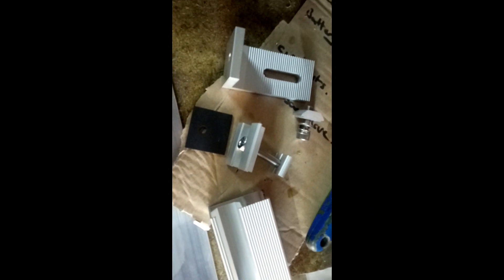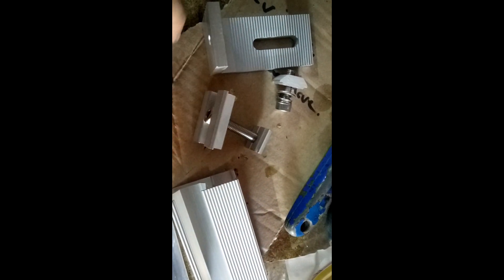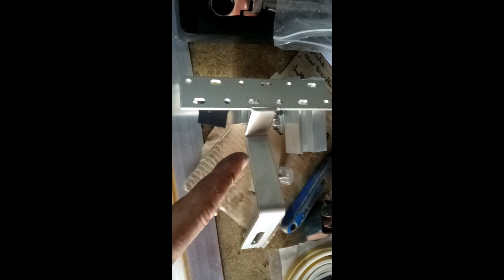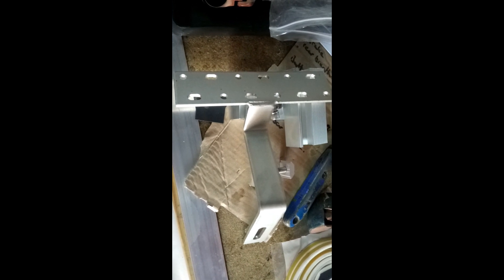Right, what you see here is the kit I used to fit the solar panels to the garage. You get a screw as well — that's the bracket that fits onto the tile. Basically you locate the joist, drill through the tile, a little rubber seal goes on there, and your solar panel is connected with a clamp. If you do go down this route — and I wouldn't recommend it — when you drill the hole in the tile make sure you put some extra sealant in that hole because this does leak. The ones I've used for the house are these brackets, which fit under the tiles directly to the joist and the tile slides back over. These are a lot better, sturdier, and less prone to leakage.